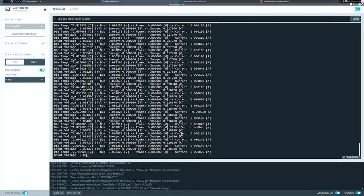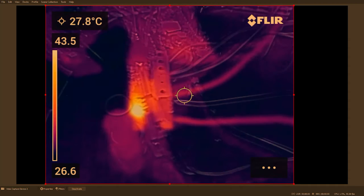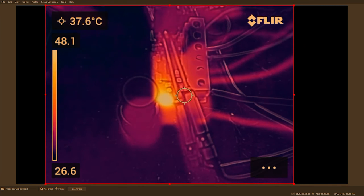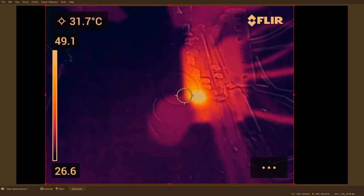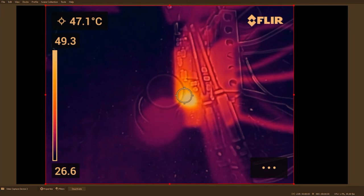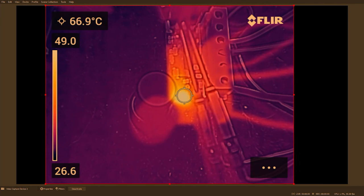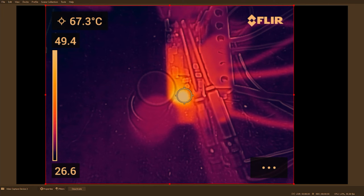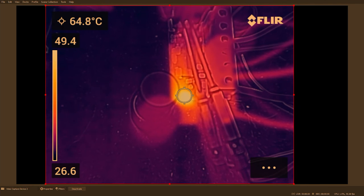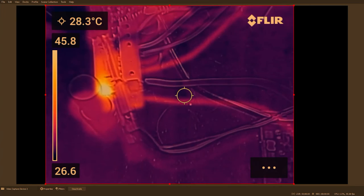Let me add my thermal camera to this and see how much heat it's generating. So this is 72 degrees as shown — this module does generate a lot of heat. The die temperature was reported at around 80 degrees. Let me keep my hands stable and put it right at the center to see. That particular module is reading around 66 to 70 degrees Celsius, so you can see it does get quite heated.